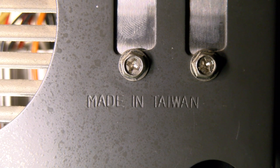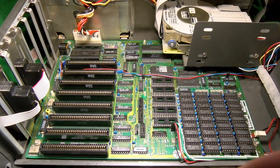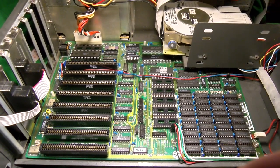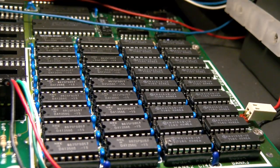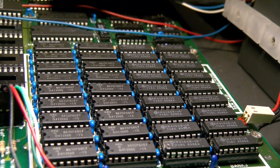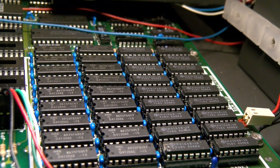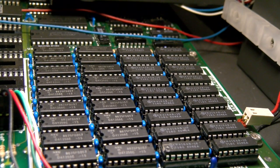I don't know. To be honest, neither of the machines are much different to the IBM original, using almost identical layouts and silk screens. It does have an advantage, though, in that it can run all 640k of RAM without requiring modifications, and this one is doing just that. In fact, this is why I bought the system complete, as buying a motherboard and RAM in my own country was more expensive than importing a complete system from the United States for some reason, hence the 110-volt power supply.